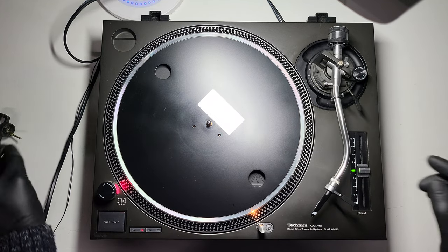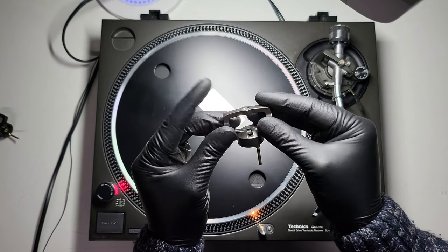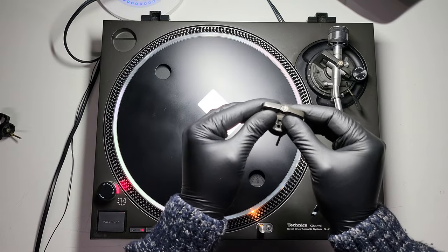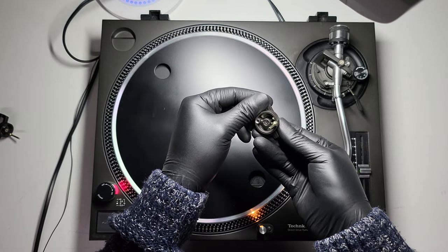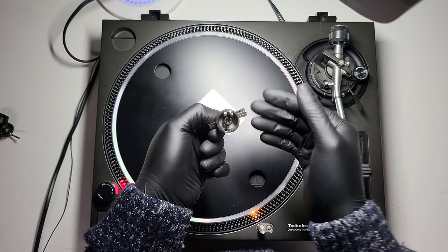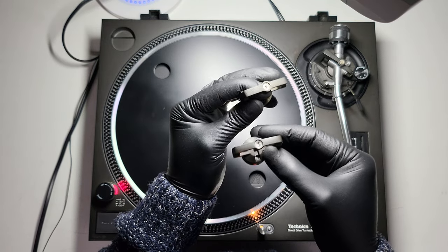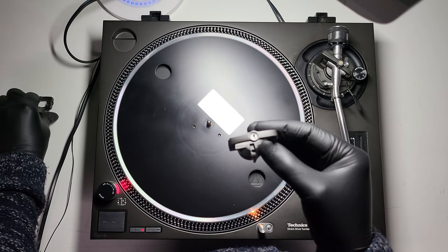As I've just shown you, the physical damage to bearing units — you're not going to be able to check this fully because you'd need to take the entire arm apart. On some versions with slightly longer cables you can undo the pivot on the top and maneuver the arm to look at the bearings. I've done that for customers here in person. But you're not going to do that at a seller's house. To summarize: one example had no ball bearings at all; the other had the plate bent at the top so the bearings won't move.